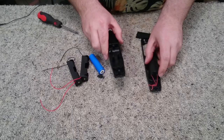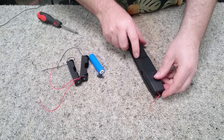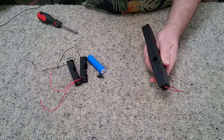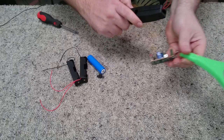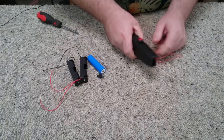I just used a Dremel tool to cut away the posts, and now the transformer does indeed fit into the housing when I line it up properly. While I was at it, I enlarged the factory switch hole to accept a momentary switch, because unfortunately the switch it came with is mounted on the PCB board and we're not going to be able to use that. That pops in there and now we've got a switch again.